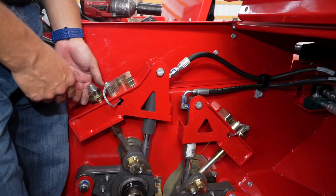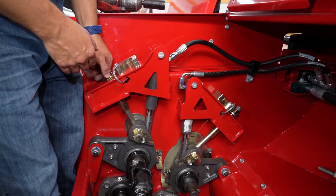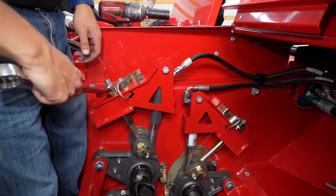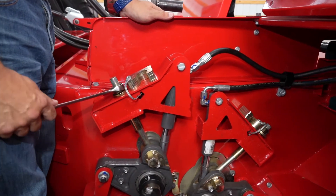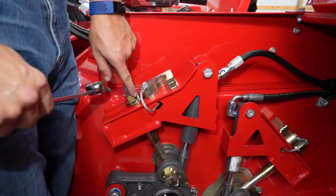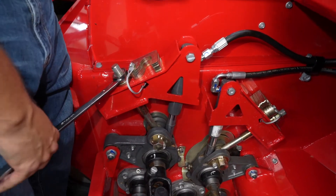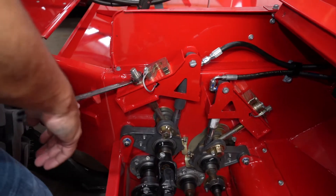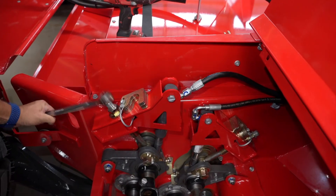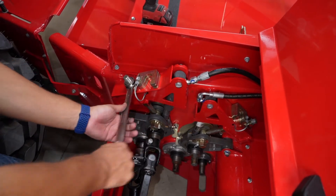To bring this process back up — I've done the same thing on the other side — you want to do both sides simultaneously. Now that you have a little tension on here, each revolution of this is going to be a sixteenth of an inch. It's easier to do it with a wrench so you can go slow enough to know what you're doing. I have a mark on here, and every time that mark comes around, it's a sixteenth of an inch. So that's one sixteenth.